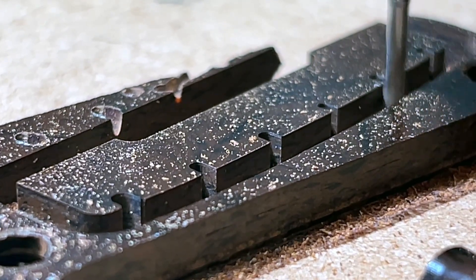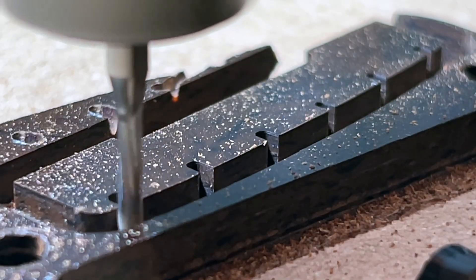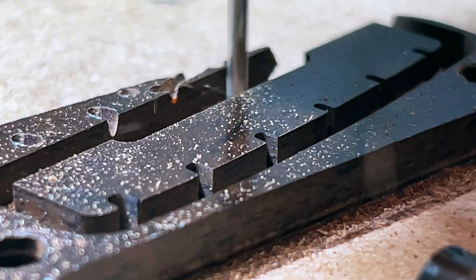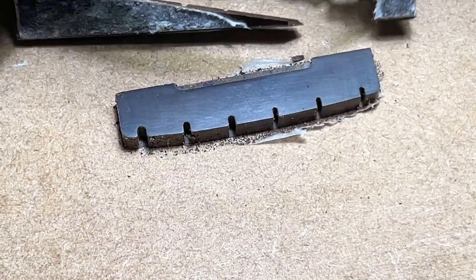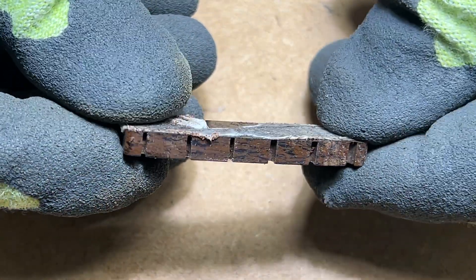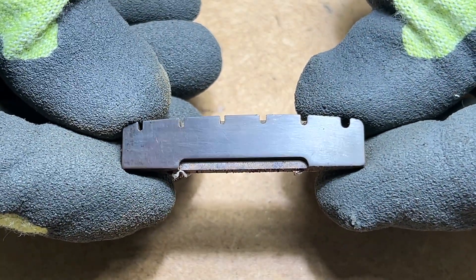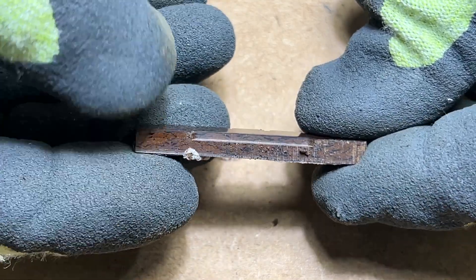The flute length on these small diameter cutters isn't normally greater than 2mm, which would only allow a partial cut requiring the slot to be filed out manually. However, partway through making the items for this video, I found a supplier selling 0.8mm diameter two flute cutters with a flute length of 5mm. I didn't expect these fragile items to survive cutting hard Bakelite, so I reduced the feed rates to a very conservative 300mm a minute, and this worked, as you can see from this sequence. The thickness of the section of Bakelite I milled this item from is closer to 3 sixteenths of an inch, or 4.8mm, and does appear to be slightly thicker than the string spacer on the original Red Special.